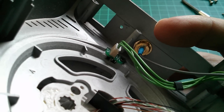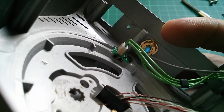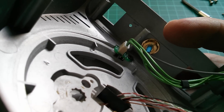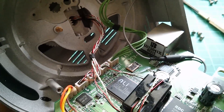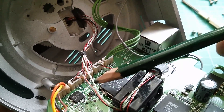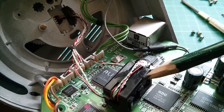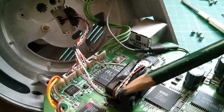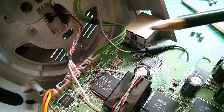As for the end-of-travel sensor, you can just see underneath how something moves around and will block the infrared beam there, and that tells it that it's reached the end of travel — so it's an optical sensor. The wires that go to the tilting head are extremely fine. I would imagine the ones on these two connectors that don't go through this ferrite block are probably for the motor, and the ones that do go through the ferrite block are presumably video, which comes down to this connector.